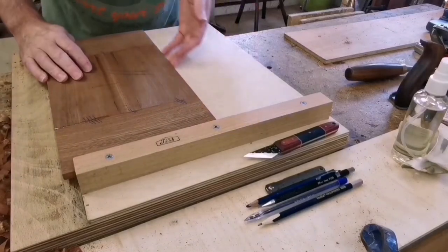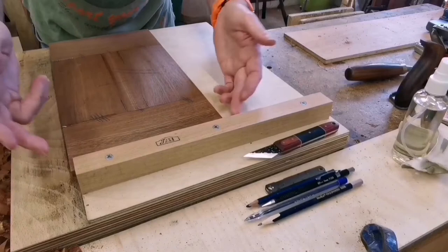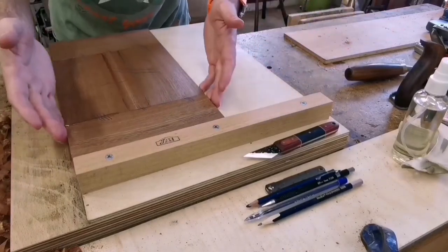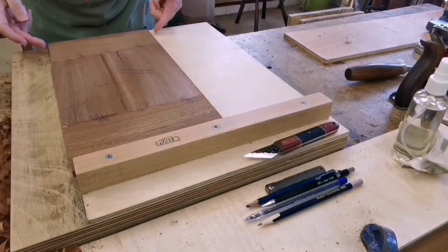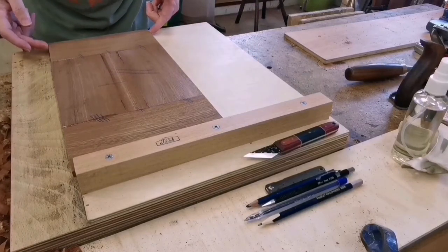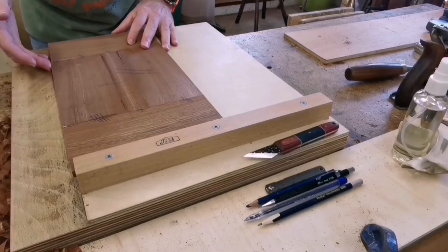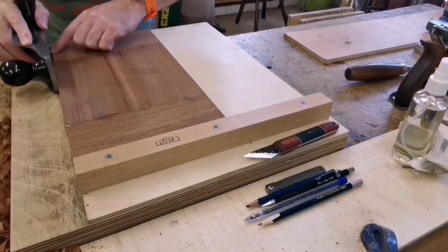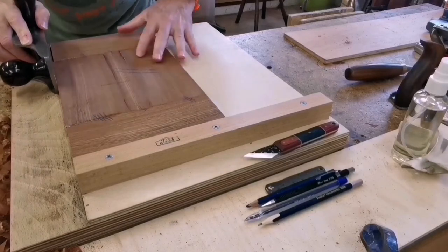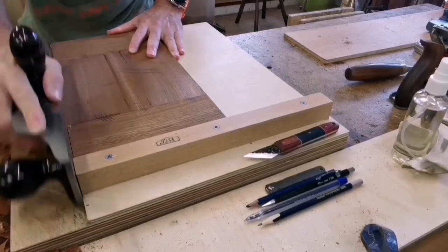Right, I've done this side already, say if you guys watching. I'm just sorting this out. I've just measured it and for some strange reason I've gone imperial. So it's 7 13/16 there and it's 7 13/16 here, which I would expect because I cut the two at the same time. But this tapers out, so all I've got to do is take it off this end. So yeah, tapering a bit, but we'll sort that. It won't take long.